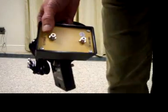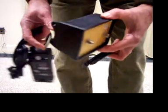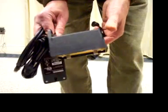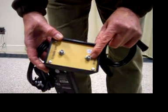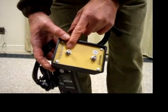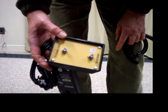This is an Antennacraft 10G212 preamplifier. This is the actual amplifier. It mounts up on the antenna, has an input from the antenna and output to the power supply. This will amplify both UHF and VHF up to about 30 dB.